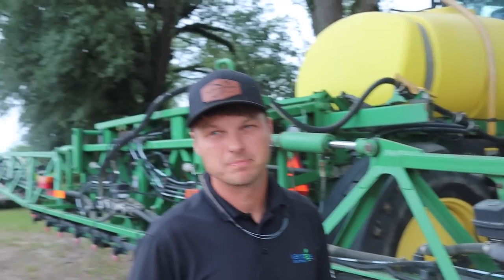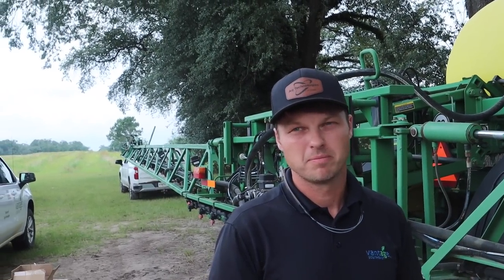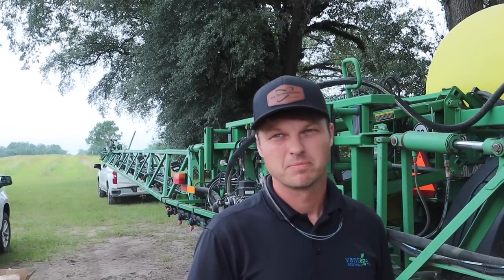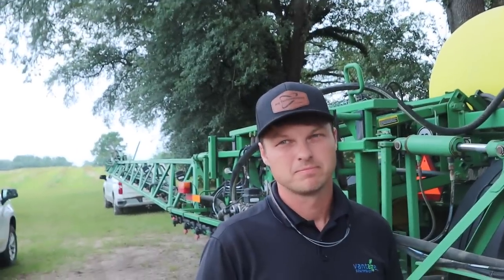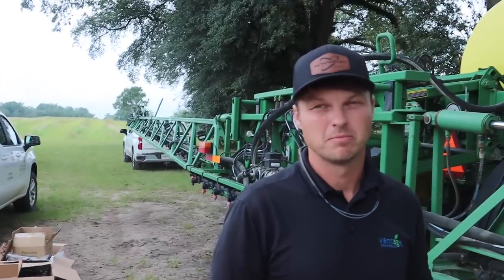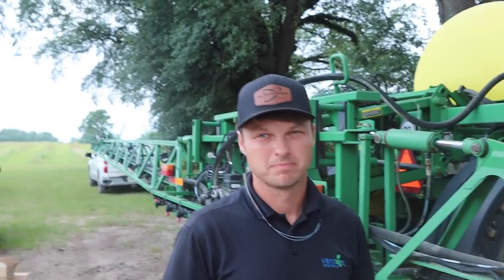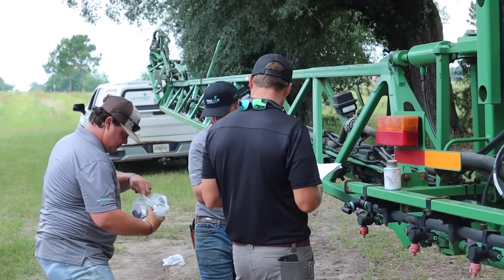Oh yeah, I agree. That's probably one of the main benefits: when you pull into a field, you just filled up all your chemicals, you're ready to roll. Right. Now we would back into a ditch somewhere and just turn it on, wait 10, 15 seconds till you see your solution coming out. So now, as soon as we press that spray button, everything should be ready to roll, mixed, right where it needs to be. That's right. Cool.